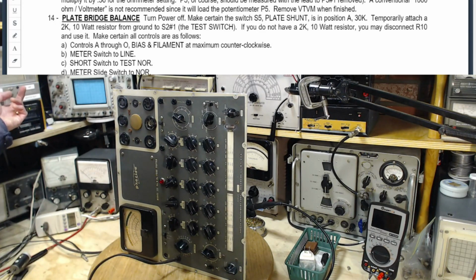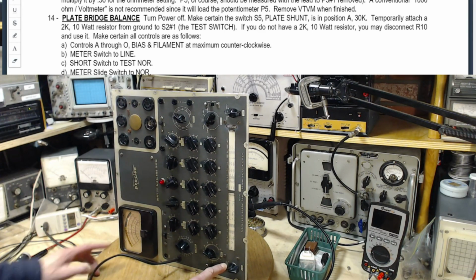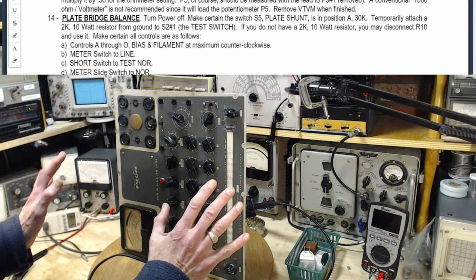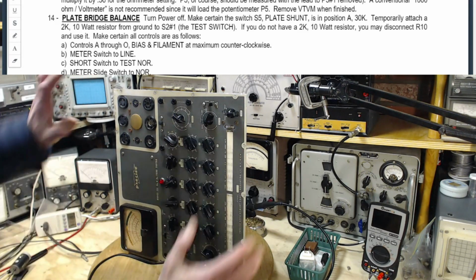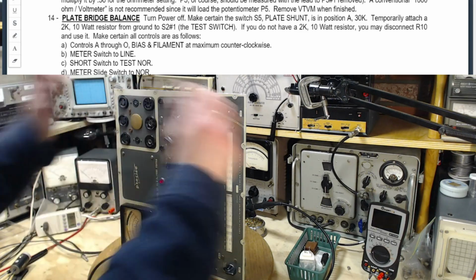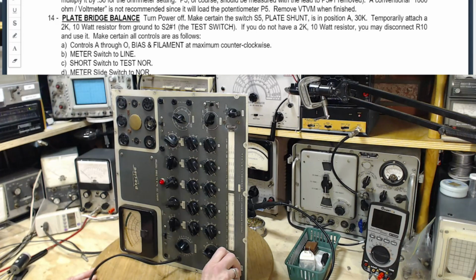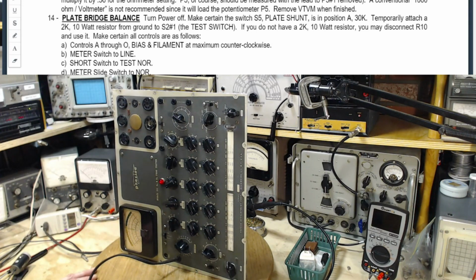Let's go full. Now I put a knob on this control last night. I manipulated the control when I did it, so not surprising. The other thing too is I'm doing this with this meter tipped, not only standing up, but standing up sideways. So, you know, grain of salt on all this, I'm afraid. And I just don't want to lay it down, but, well, you know, I'll lay it down and compare. Adjust the line here, so that should be resulting in 5 volts on that test point. Let me get this right on the money here.